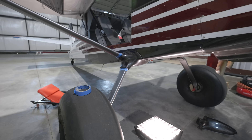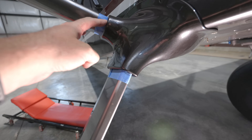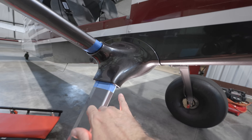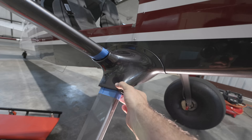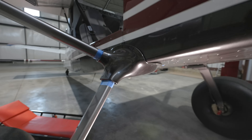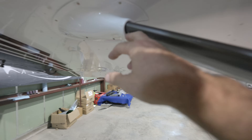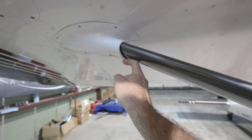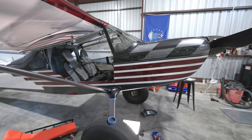This step is to have them put in place and then mark the very edge with masking tape on both the lift strut and the gear strut. Take it off and then put some foam tape, because you don't want water getting up in there. This is for water intrusion and probably for vibration as well. I might end up finding a low point and putting a drain hole down there at some point. This one doesn't have foam — if you look at it, the water will drip out, might puddle up a little, but eventually it'll get out. Let's get these guys off, get the foam tape on and get them final installed.